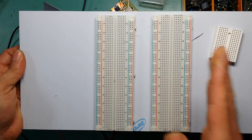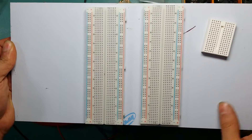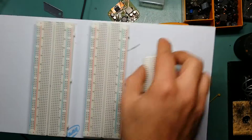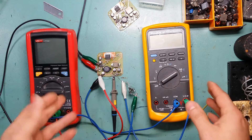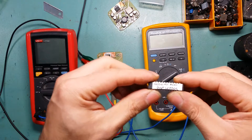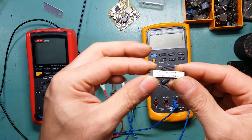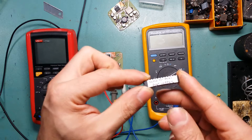I'm going to make a platform with three separate Arduinos and a lot of breadboard around in the middle to allow me to do prototyping and tests. The first thing I needed to do was make a power supply for the Arduino. The chip runs from 1.8 to 5.5 volts according to the datasheet. If you run it at five volts you get the full speed of the microcontroller, which is 20 megahertz. Running it at less gives you eight or ten megahertz.